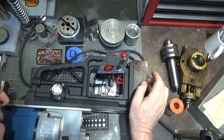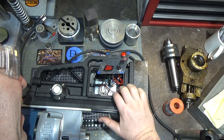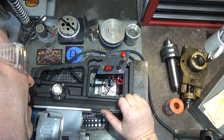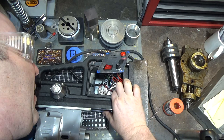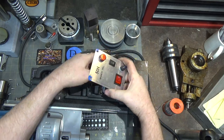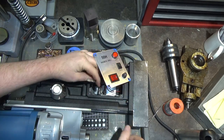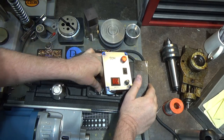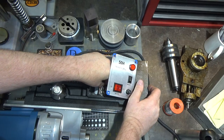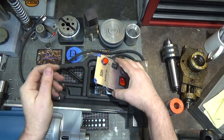It's inexpensively done but effective. It looks like this magnet could have been wired for 120 or 220 — but it's in series, which you'd think would be for the larger voltage, but I'm running this off 110. There are two coils in this electromagnet, and you could run the coils either in series or in parallel. The spade lug connections are not making great contact at all.